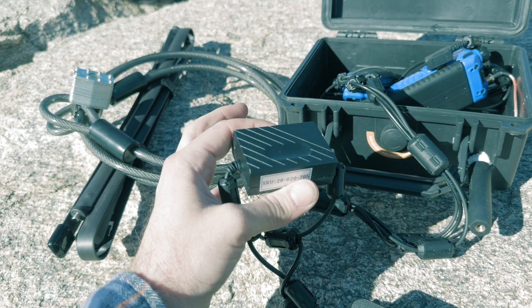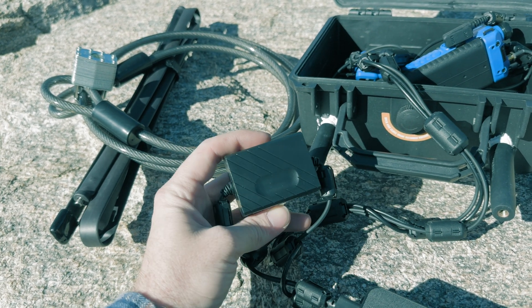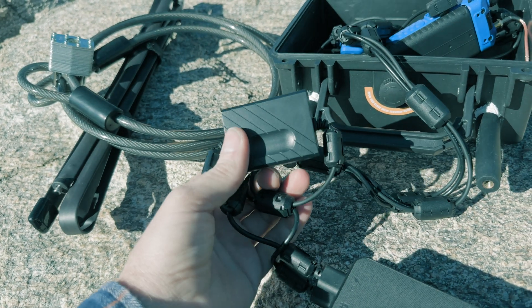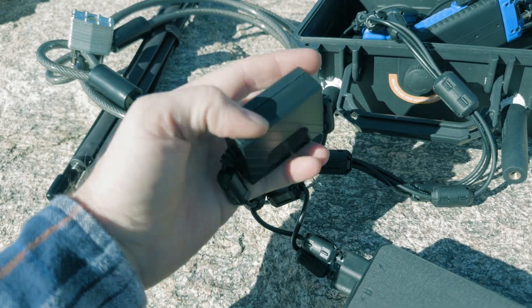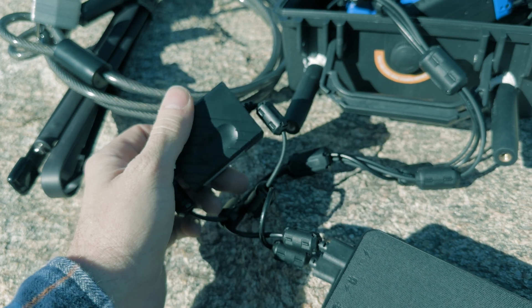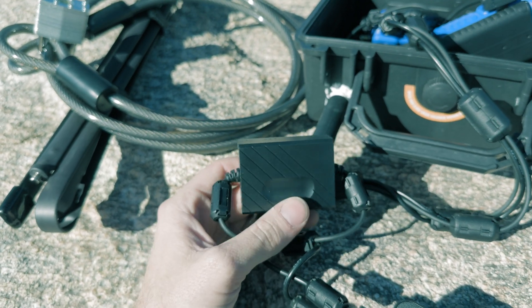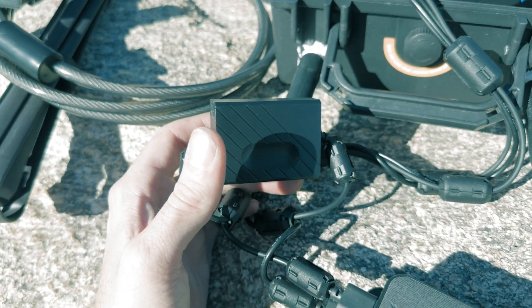To make all the magic happen I have this K1 repeater box. If you search Amazon for 'K1 repeater box' you'll get about a dozen of these. I got the one that would actually ship to me within the same month — it was $22 instead of $19, but it was shipping from the US and not China. They're all basically the same generic unit. This one is bidirectional, which is why I say only have the Roger beep on the transmit side — it doesn't matter which end goes into which radio.